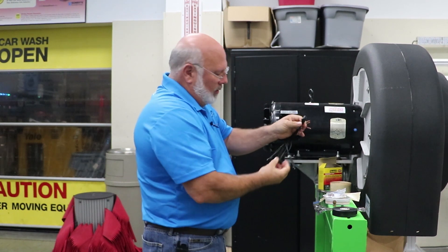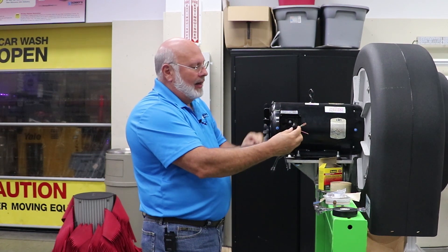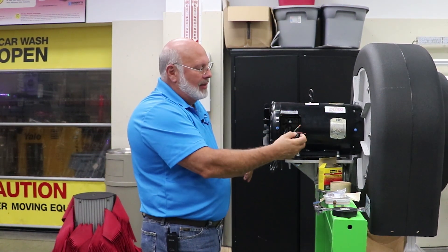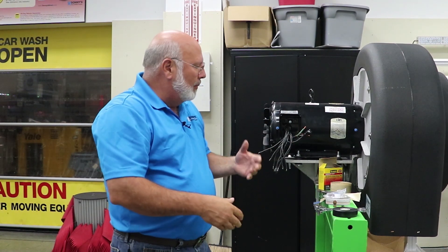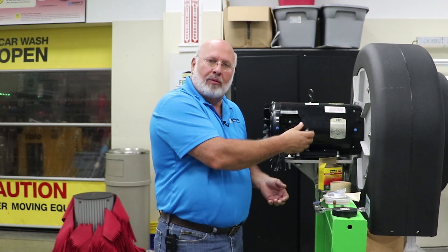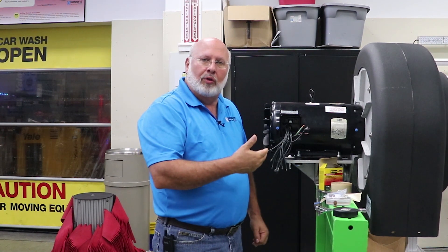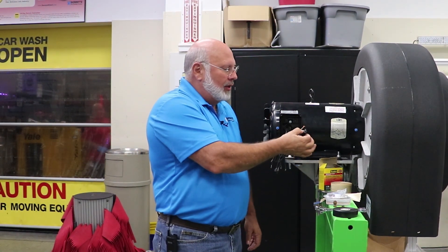So that looks like a properly insulated connection, and this one here looks like a nice tight, waterproof, watertight connection that's not going to get hot or short out against the box. Make sure you split your wires back far enough to do it right. If you open your boxes and have problems with motors shorting out or single-phasing and the wire nuts are burning off, this is why we use split bolt connectors. If you want to check on your electrician, have them leave the boxes open and make sure they did it correctly — then you'll have a long and steady life. Thanks for watching, and for more frequently asked car wash operation questions, visit us at sunniesdirect.com/faq.